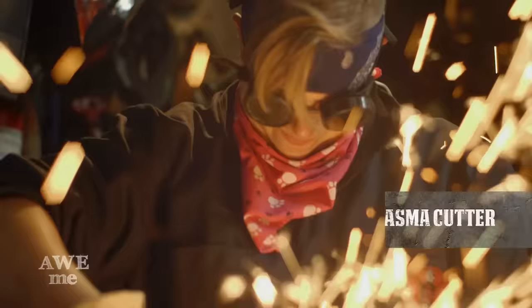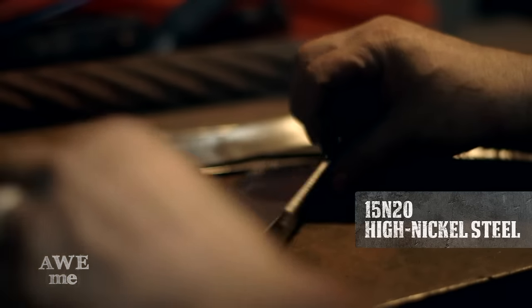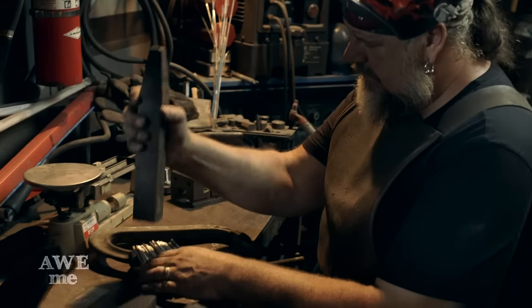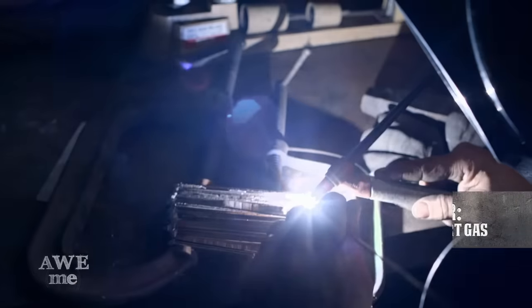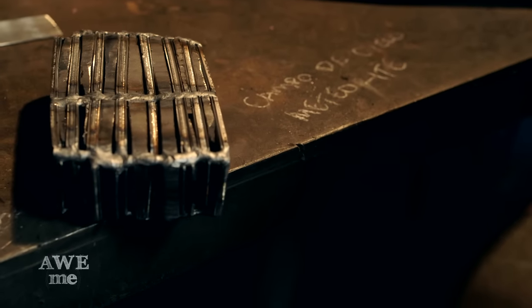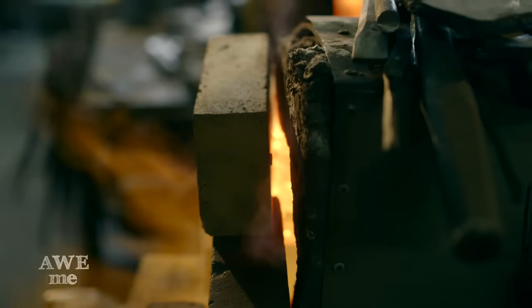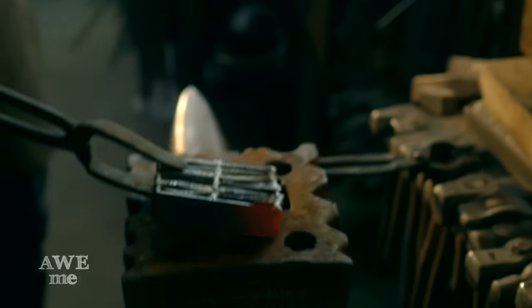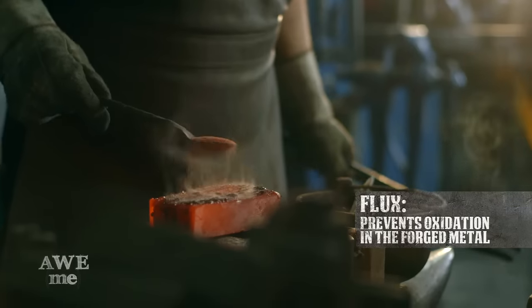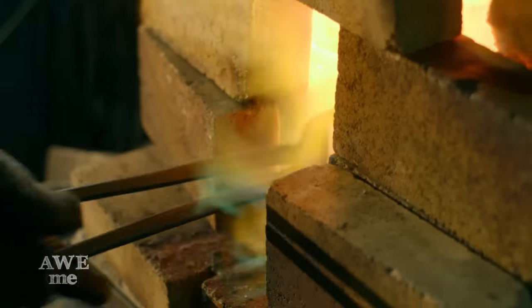I'm going to incorporate 7 slices of meteorite, 14 pieces of 15 and 20 bandsaw blades, and 8 pieces of 1075 spring steel. I'll laminate those together to have 29 layers, forge that out to a solid homogenous ingot or billet, and then fold it twice to become 87 layers. I'll do it again after that's forge-welded together to become a total laminate count of 261 layers.